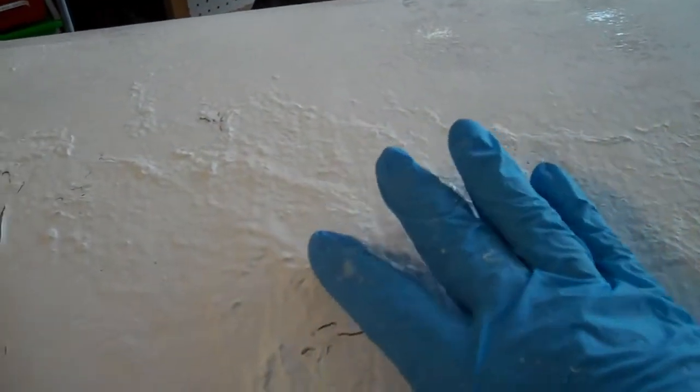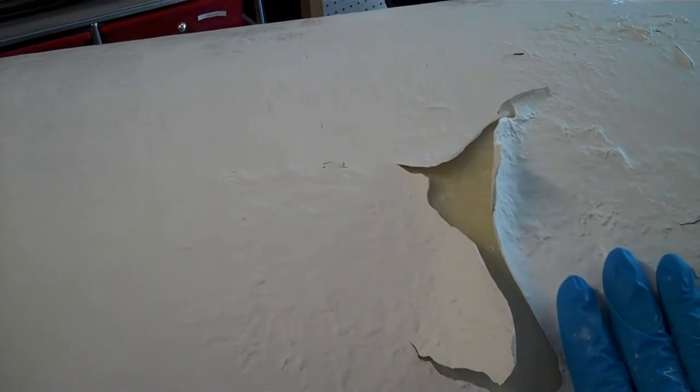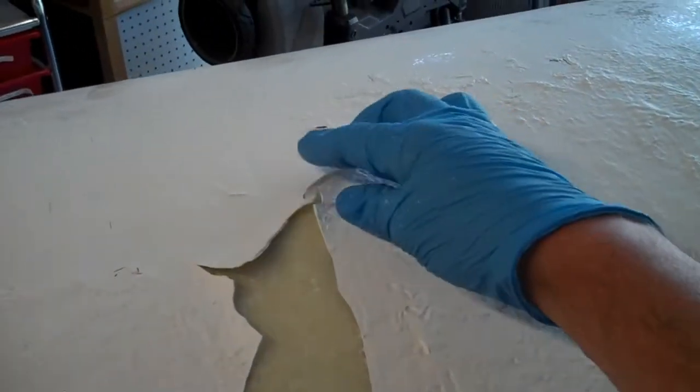You can see from the paint tray it had kind of blobs and hard lumps. Also in an area where it was too thick, the heat built up enough that not only the layer I put down, but it adhered to the layer below it, dried it, and then cracked it up. So I get this xenomorph-popping-out-of-my-pontoon type effect. I'm going to have to fix that, and I won't be using polyester gel coat — I think I'm going to be going to some type of epoxy. That's what happens when you put it on too thick and it cures too fast because you have too much hardener.